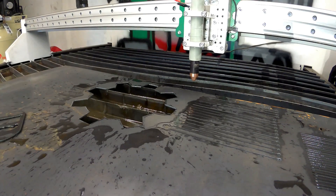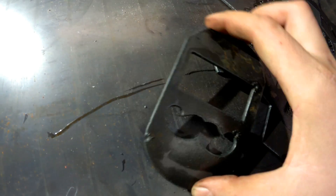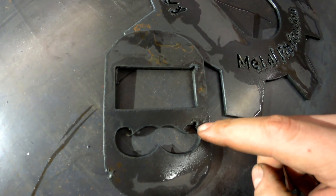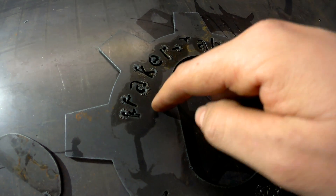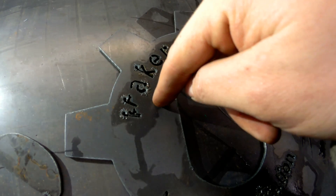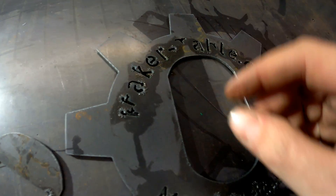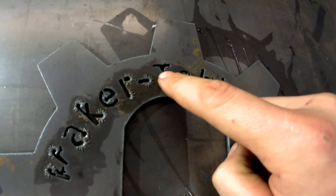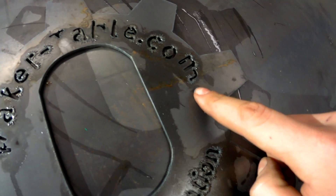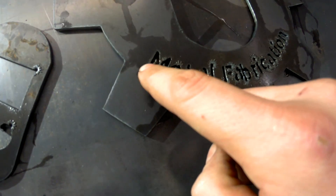Still some kinks to work out — but that's pretty damn cool. So this is what we're working with here. Looks like I don't have any lead-ins for any of these, so I've got marks where it pierced. The torch was running into the plate sometimes when it did its homing move or Z-move — it wasn't coming all the way back up every time, so it was getting knocked off and I just manually put it back on. That's where these cuts and these letters got messed up — same thing on the T, the B, the M.